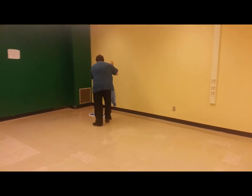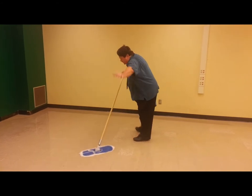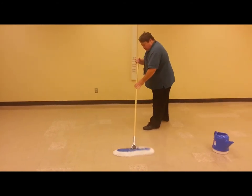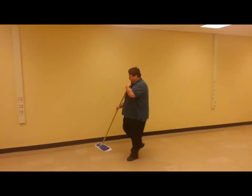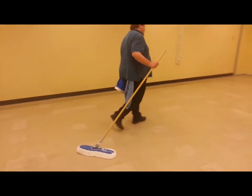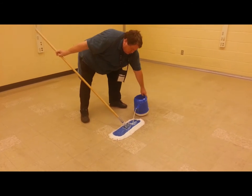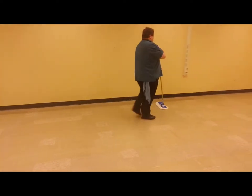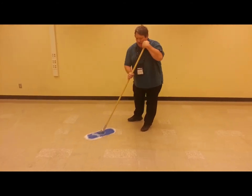Here's where we do the regular figure eight. I'm pulling farther from the left side because there's more finish on my left side, staying away from the wall for the first coat. It was fairly wet still — I brought it down to my edge. I use a landmark so I know where I'm working; it's very important after you have multiple coats on the floor. Now we're going to re-wet the mop. This time I'm going to pour less because I showed you how much you shouldn't have. You pour until it leaks out again. Move back about a foot, move forward, and fill in your horseshoe. Notice I don't go past my pour line that I brought up.